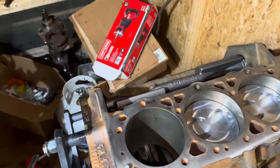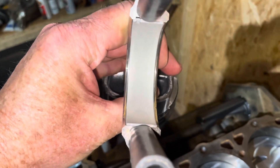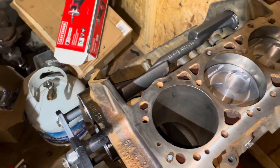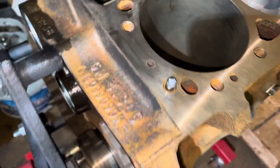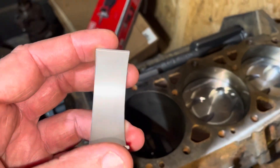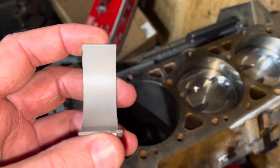I'm about to put this last piston in, and you can see the bearing for piston number six — that bearing is the same for all pistons. That bearing is unique to the 4.3 liter V6 General Motors engine. This other bearing came out of a V8 — this is what goes in a 5.0 or 5.7, and also some wide-bearing 3.0 liters.